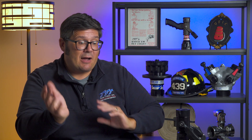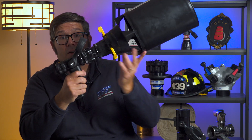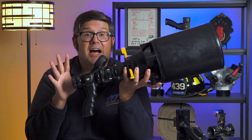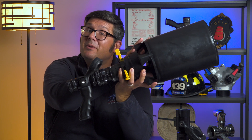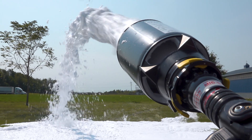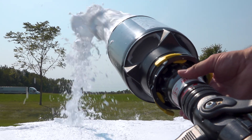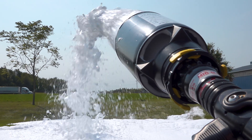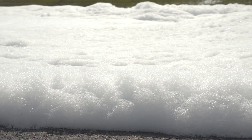If you want to go down another road and just use a standard 1-inch nozzle, you can absolutely do that. But I would recommend, when using the 1-inch nozzle, get a separate foam attachment that clamps onto the end. That foam attachment entrains air and aspirates the foam solution, allowing you to deliver that good quality finished foam.